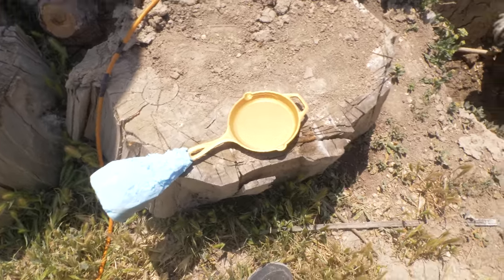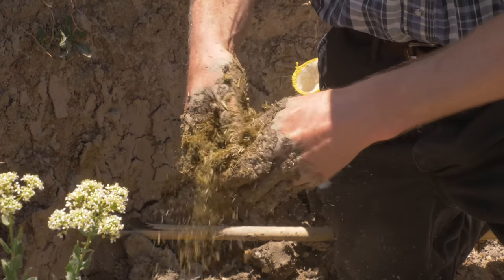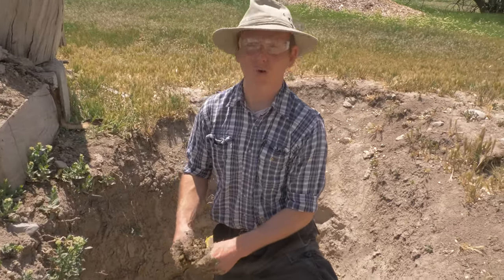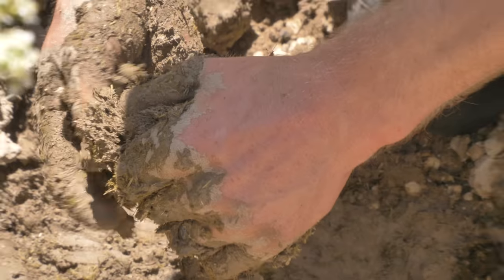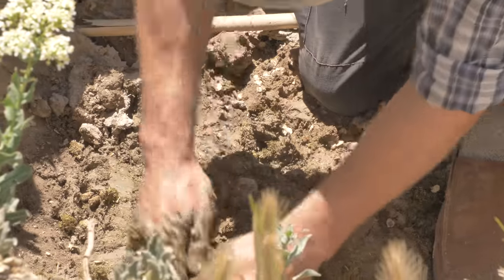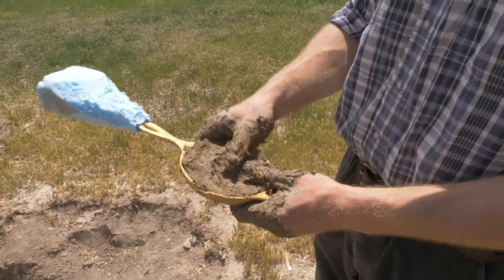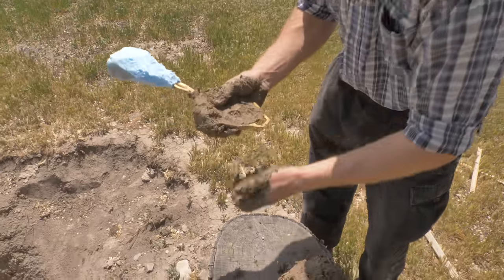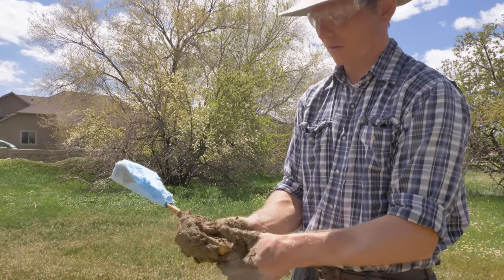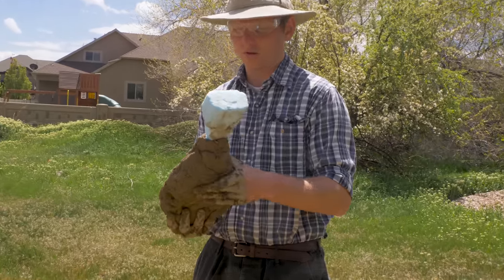So I'm playing in the mud to work on a mold for the frying pan. This is a mixture of mud and horse dung. Horse dung is really good for making cob — it's got a bunch of short little fibers which basically act like rebar in concrete. And the reason you want to use horse dung instead of just grass clippings is because A, you can use those grass clippings to feed your horse if you have one, and B, it's already been fermented and broken down so it's not going to change size and shape once it's in the cob. Historically this is the good stuff. What I'm going to do is make a big jacket of cob, put it around this 3D-printed form, and use that to make a mold. The horse poo burns away, which actually creates air holes that allow the clay not to experience quite so much thermal shock when we cast iron into it. Now I'm going to heat this up slowly to dry it out, and then we'll have something to pour iron into.